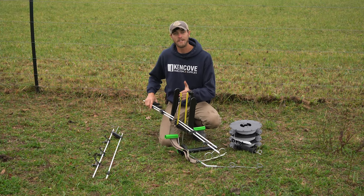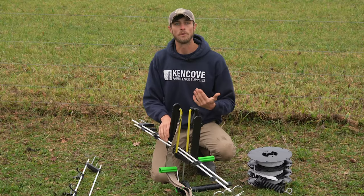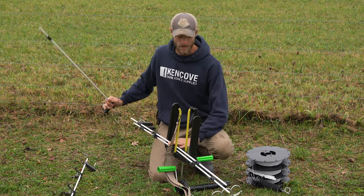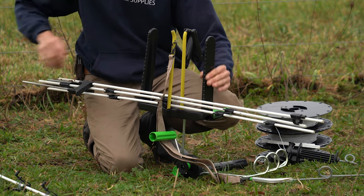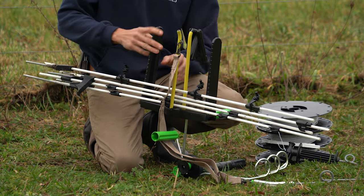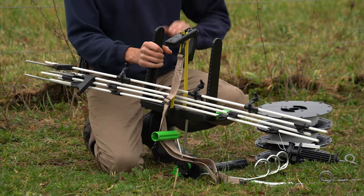We also want to pay attention to the sequence in which we load the posts. We want the sequence to match how we're going to be pulling posts out as we go down the line. So in this case I need a few line posts in this direction and behind me I'll need my brace assembly. Now that we have our line posts in here I'm going to add my brace post, stagger that foot again, and then our end post with our release hooks. When you're finished loading posts, throw the latch for the rack — this adds tension to the post and holds everything securely.